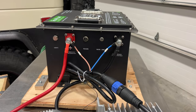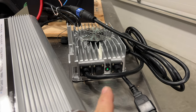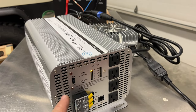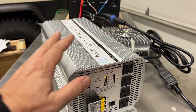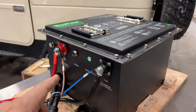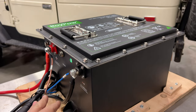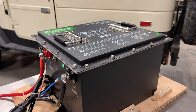I can turn the battery on and a light will come on, but it won't stay on for very long. The light on the charger should be flashing if it's charging the battery, which it's not. The only way I can tell the charger is outputting power is because the inverter has power right now, and it's not coming from the battery — it's coming straight from the charger. There weren't any instructions that came with the battery, so I'll just turn the inverter off and let this sit to see if anything changes. I think what might be going on is it's very cold in here — probably about 50 degrees Fahrenheit — and possibly the battery has some sort of thermal protection not allowing it to charge or discharge. I may need to move this into another room and warm it up.